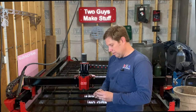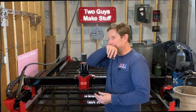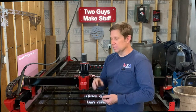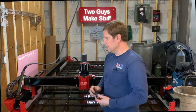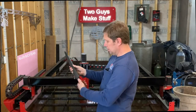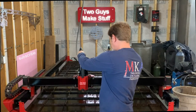Usually it depends on what we're cutting, but sometimes we can get a lot of use out of one set. We had a big cut that took five hours, and in those five hours we were able to use one set of consumables. It was pretty beat up at the end — we probably should have changed it sooner — but those were the fine cut consumables, and we got it done. The assembly just screws onto the end and slides into the floating head.